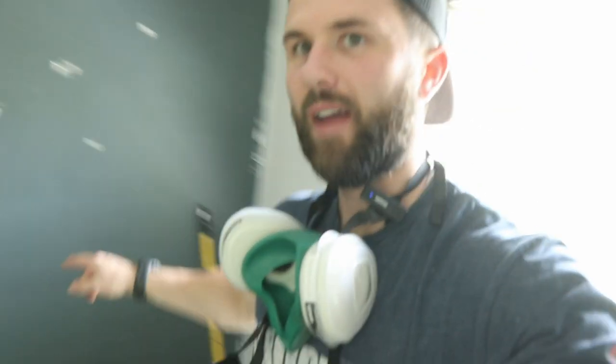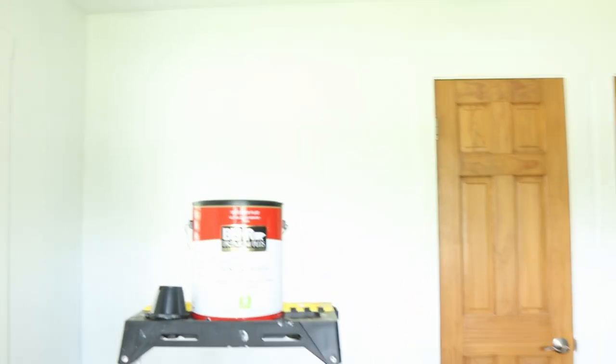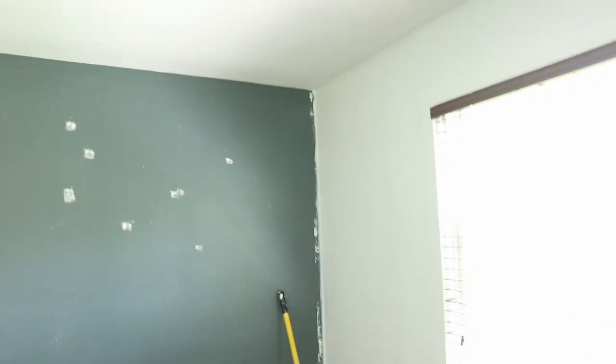We are officially ready to apply some paint here in this DIY nursery for my upcoming newborn with my girlfriend. Got the sander hooked up with 220. We are about to sand these primed walls, just these three to start. We are going to be working with the Behr Premium Plus paint and primer in the color Bit of Sugar — using the interior flat white ultra pure white. I am going to start sanding these walls, cutting in on the tops, the bottoms, around the window trim, and we will get this paint rolled on. Then we will start on this wall with Cracked Pepper.